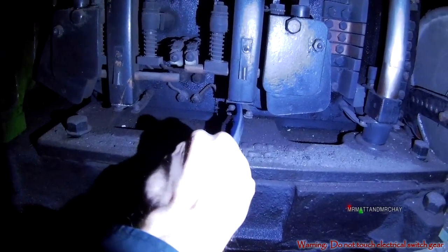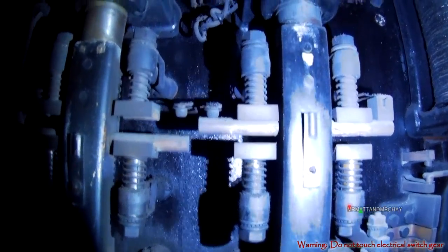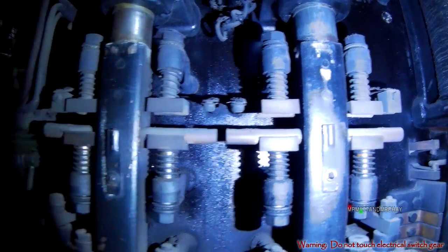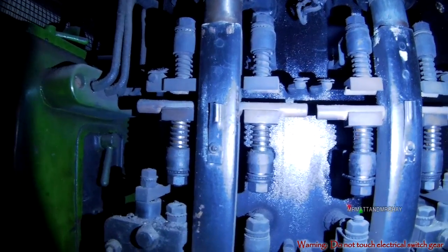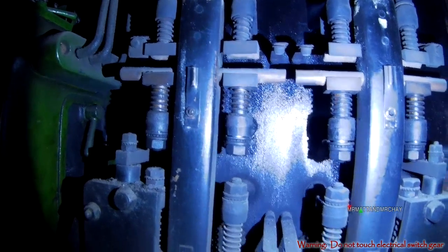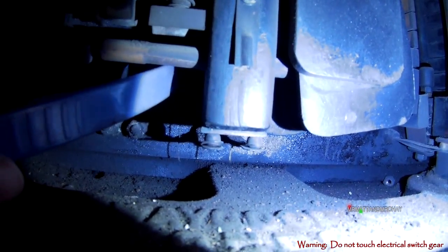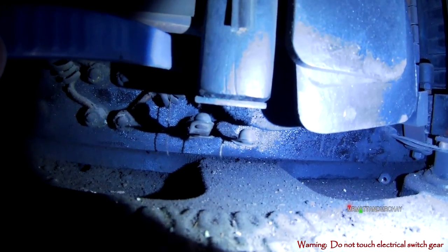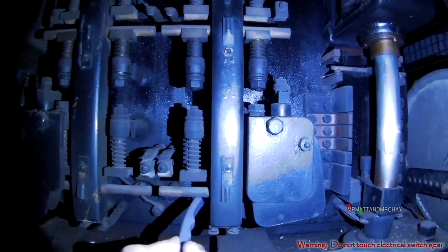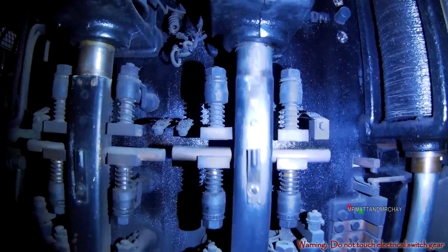The up and down relay should not come on at the same time. Only a malfunction could let this happen, but normally there is something physical that blocks the path of the other relay from coming on. This is also known as an interlock, but these do not appear to have this. At the bottom is a set of contacts that join together when the relay is off. When this relay comes on, it disconnects the other relay's electromagnet. So, while the down relay is on, the up electromagnet is disconnected, and vice versa.